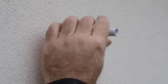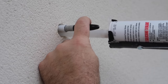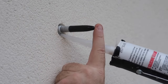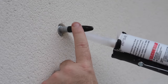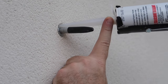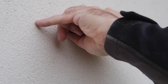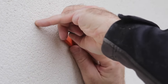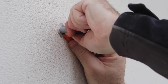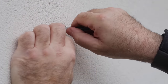It's important first to get rid of any residual dust in the hole so the silicone can bond properly to the blockwork. As I'm fitting this flush to the wall, I have the idea of ramming a Sharpie into the end to have something to hold on to while pushing in the silicone. It's good to fill silicone in starting as deep as possible to get a really good seal. The Sharpie trick worked really well — until I had to get it out, and then I realised I'd maybe pushed it in a bit too much.